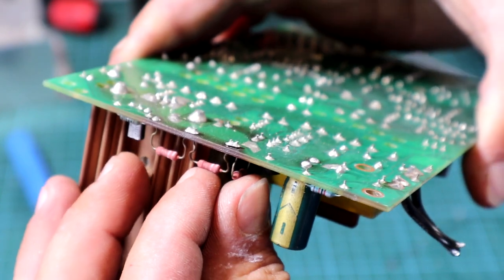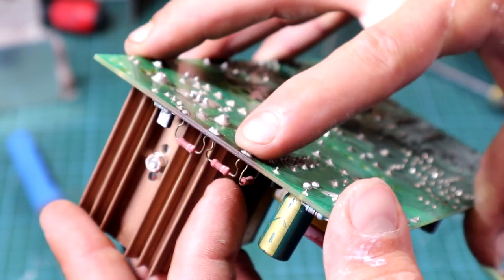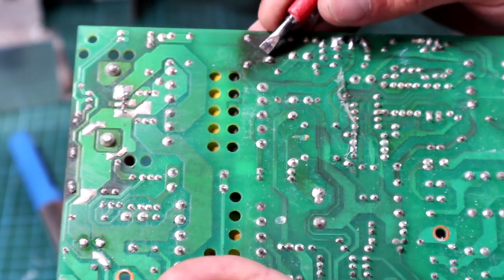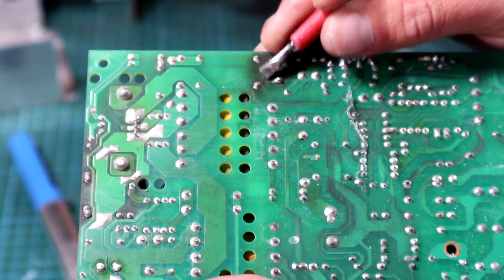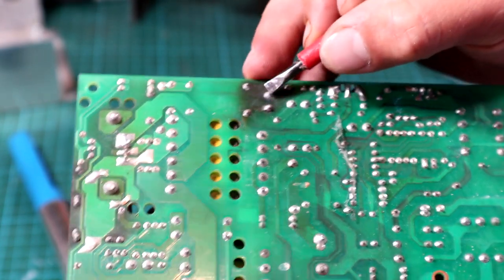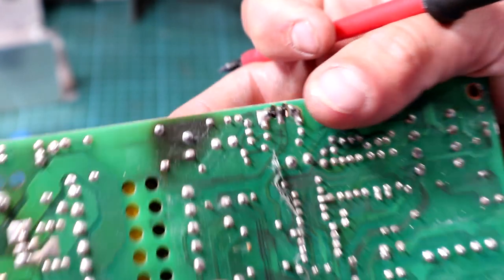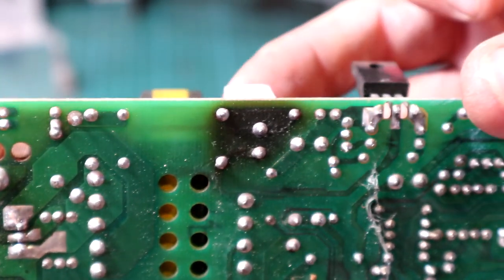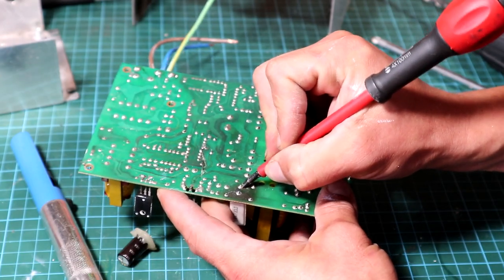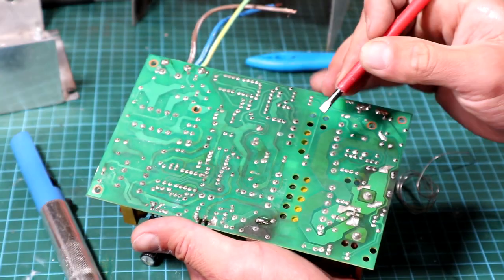With the new cap installed, let's look at the burn marks on the board. Some of them look like the resistors have been unsoldered - they're still attached but the pad on the board broke. They don't seem to be connected anywhere, just in series. There's also a slightly burned pad on top that's a bit deformed by heat. This unit is not meant to be run without proper ventilation. One pad is nearly coming off from this high-power resistor. Using a flat screwdriver I'll slightly peel away the mask on the PCB and then add a bit of solder - and like that, it's fixed.